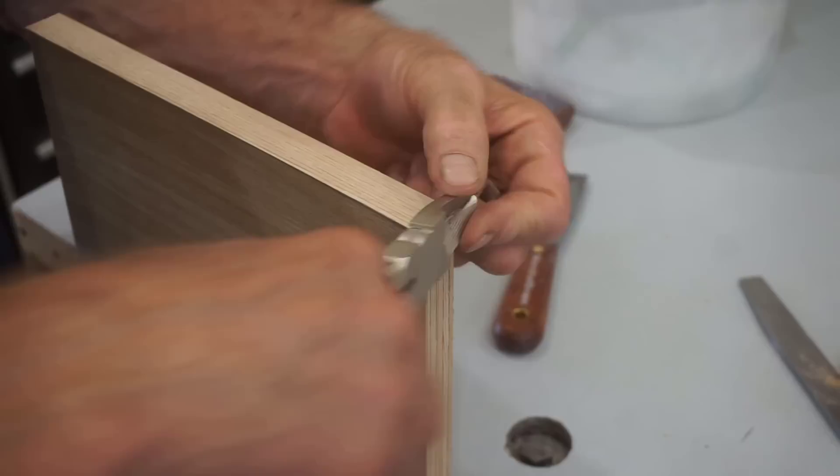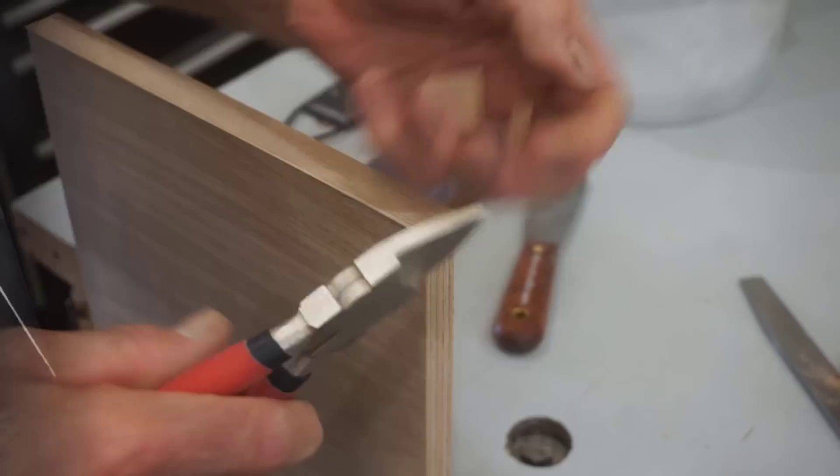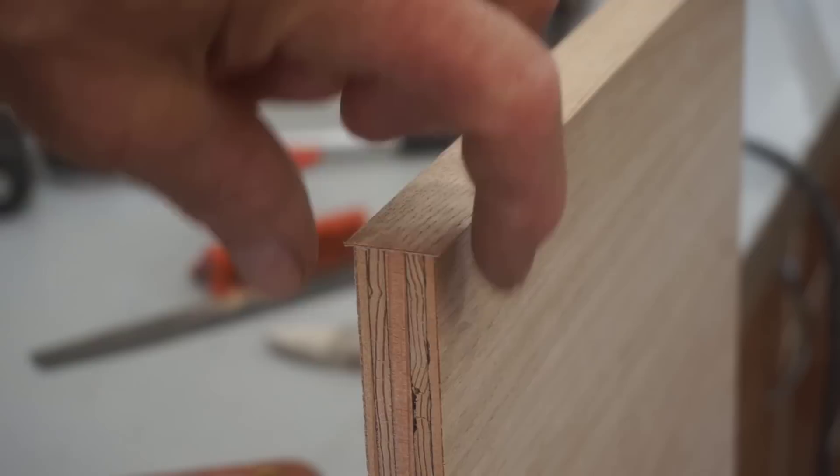So I can take the flush trim nippers. I hold the flat backside of the cutters up against the end of the shelf and give it a nice clean snip. I try to hang on to the piece as I cut it off. Naturally I do both ends. These snips are nice and sharp — I've had these for a number of years and they're still cutting like new. If you happen to misalign that and get a crooked cut, this thing will snip just about nothing off there. They really do trim flush, so even if you don't get it lined up the first time you get a second chance.